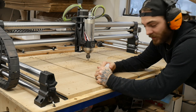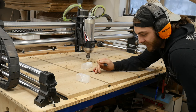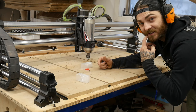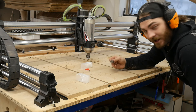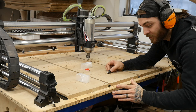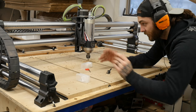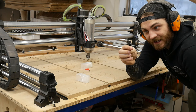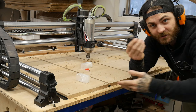On my first CNC, I pretty much never flattened the wasteboard — I don't even know if I ever did. But let me tell you, it makes a huge difference. If you're cutting V-bit type stuff, you'll notice inconsistencies especially over a large area. If you're cutting small pieces all the time, you'll probably never notice the difference unless you cut one here and one way in the back corner. Starting out, you don't have to do it, but I'd recommend it. I use a cheap flattening bit I got on Amazon — I think it's like one inch, I'll post a link in the description. It's just two little replacement blades you can rotate, and it's all I use it for. I typically do my first surfacing pass at 0.03 inches, and that usually gets me pretty close. You may have to do it one more time with a tiny little pass, but it depends how cupped and dipped your entire wasteboard is.